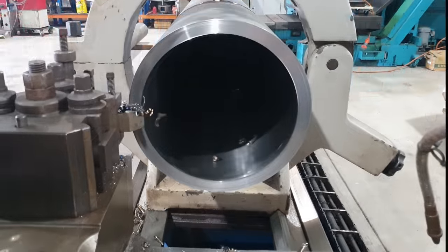So these are the drive plates I'm going to be welding into the end of the tubes. I have a drive plate for one end and a blanking cap for the other end. The customer manufactures these in-house and then supplies them to us. They do have a direction on which way they go in. There is a recess machined into it for a spigot to locate the plate onto the rotator, and then they use X amount of bolts to then hold those two parts together.